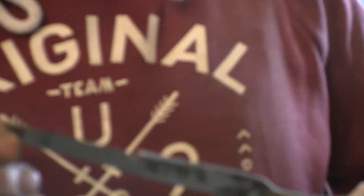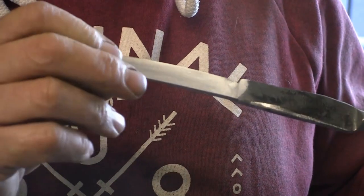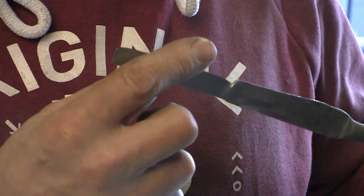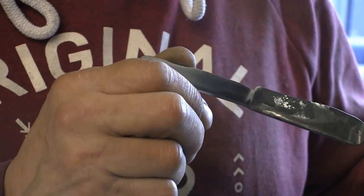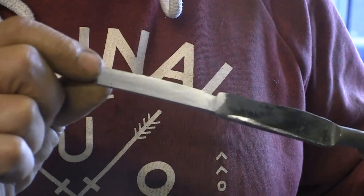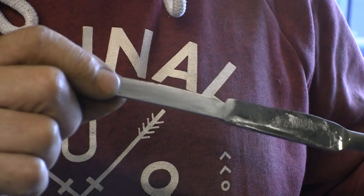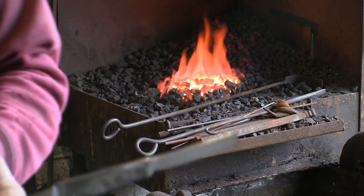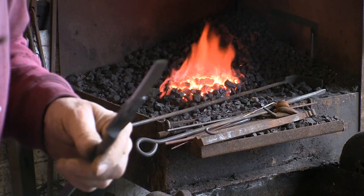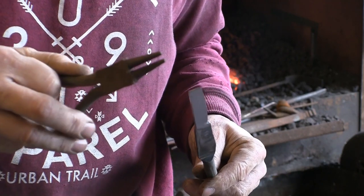You can just see — the camera won't focus but it's starting to now. You can see even though this file is really fine it still looks quite rough. I've gone over it with some fine sandpaper — I didn't show you because it's so boring — basically just rubbing a block of wood with a bit of foam grit over it until it takes a lot of the file marks out. It still hasn't completely got them all out but it's got the worst of them. The amount of effort you put in is what you get out at the end. Now these are what I'm going to use to bend the end up — a pair of circlip pliers with the ends broken off.